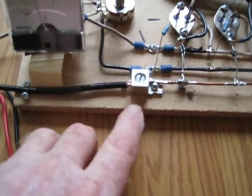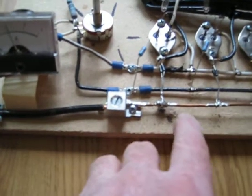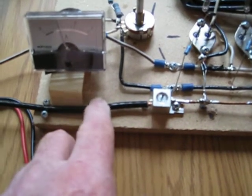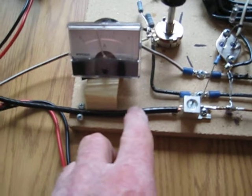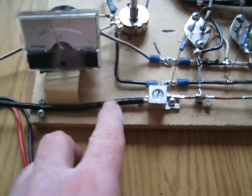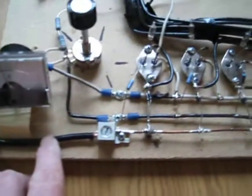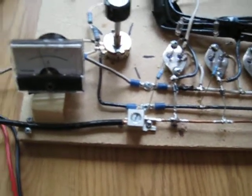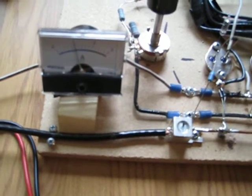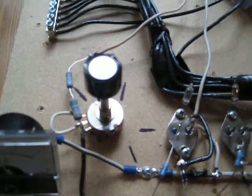I changed it — got one of those lugs one of the guys recommended. Comes straight off the bus, got it secured to the board. I took that wire down to Lowe's where I got it from and showed the guy, and he cut me another piece to replace those damaged ones. So I went ahead and stuck with a number 10 wire coming off of the bus and has that run back up. Soldered it in real good, serious wiggle test on it, everything's fine. We're running about one amp draw off the primary. Everything's still the same thing coming off of the potentiometer.